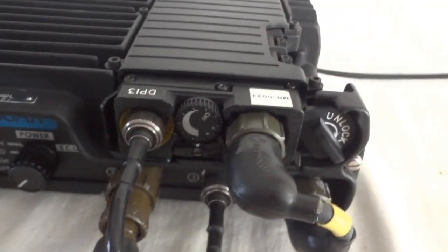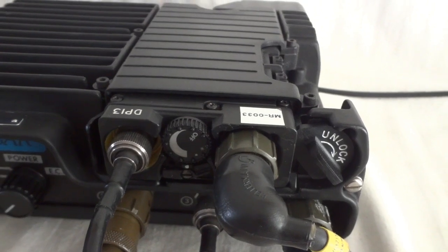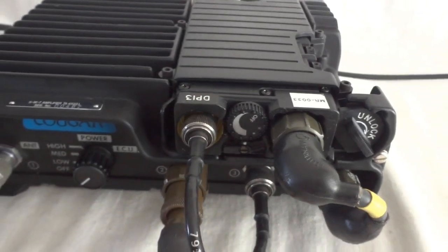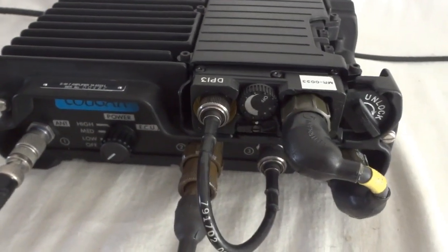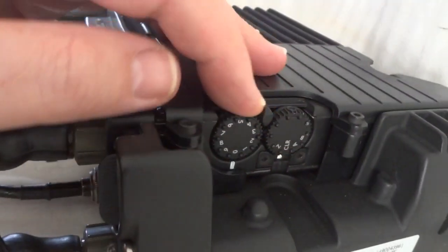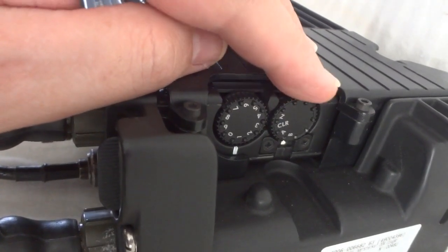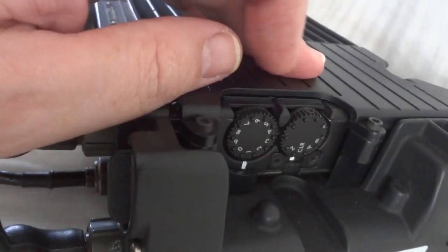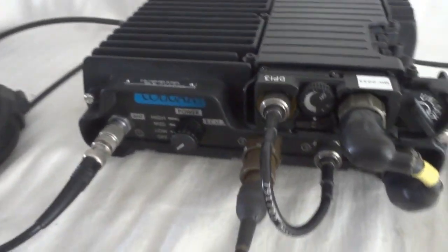The actual transceiver unit, which can also be used portable as a handheld device, is the PRM4515L, which we'll show you later outside the cradle. The radio is capable of encrypted voice, digital encryption. Here you see the channel selector, and here you see the selector for the encryption keys. There is encryption key A and B, and there is clear, and N allows you to zeroize the encryption key in case the radio is about to fall into enemy hands.